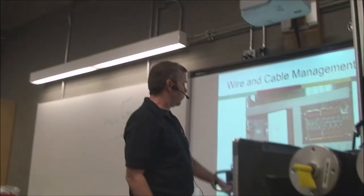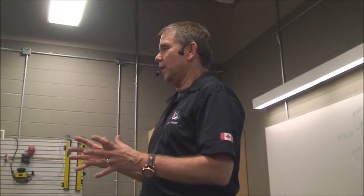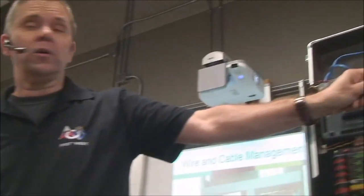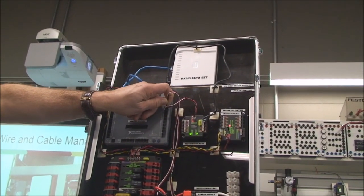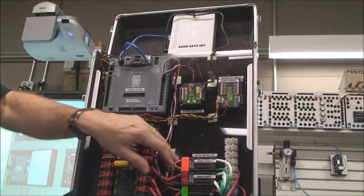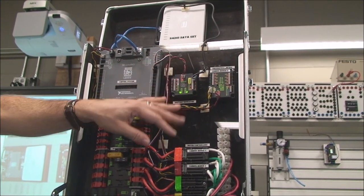Yeah. And as Max alluded to, very important, and we do this in all our industrial control systems. We do a schematic diagram of all our control systems, and all our wires have numbers on them, and those numbers are actually labeled onto the wires themselves at both ends. So if you have a digital I/O, you would have it labeled on your wire, DIO1, and at the other end where it comes up, DIO1, so you know where it came from and where it's going, right? All your power cables, all your CAN bus cables, everything should have a label on it.